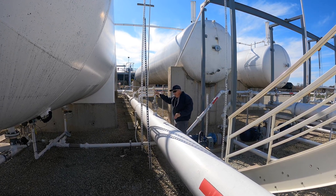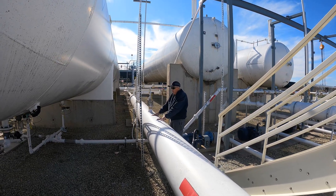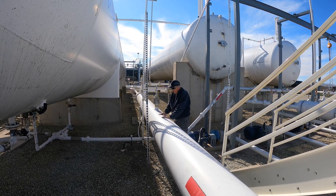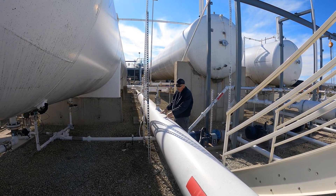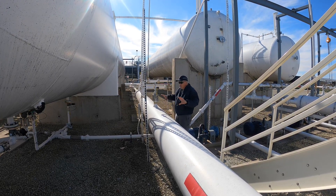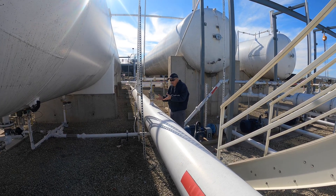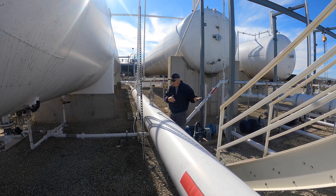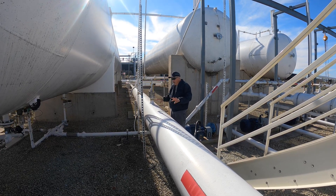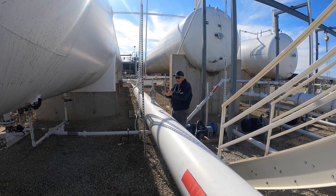Here's where product comes out of my tanks, into this trunk line that feeds the pumps. I talked earlier about vapor pull-offs to get rid of vapor from a liquid line — that's what this repurposed valve is. It's protected by an excess flow valve here and one up there. It always gives vapor a place to go, and when the trunk line is fully liquid-full the liquid will be up to approximately the height of my tanks. This is extremely handy in summer when the trunk line can be half full of vapor — even a quarter full of vapor.